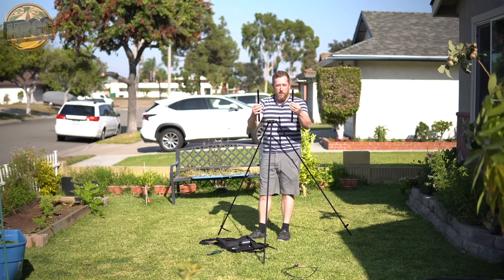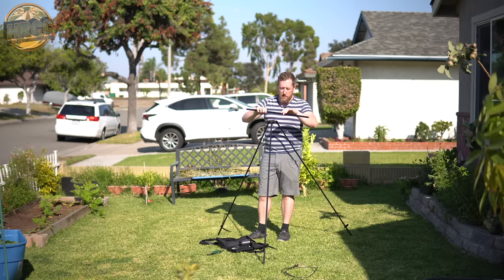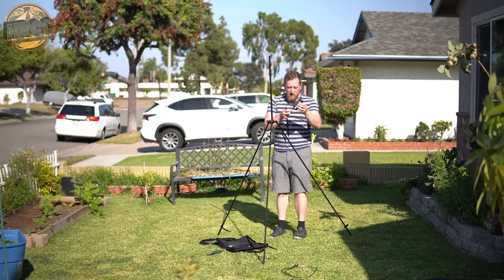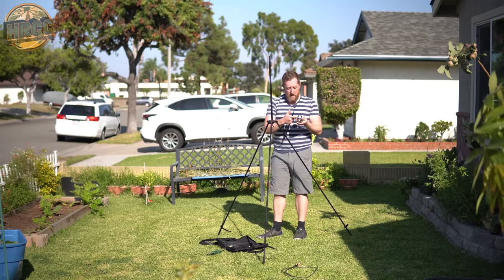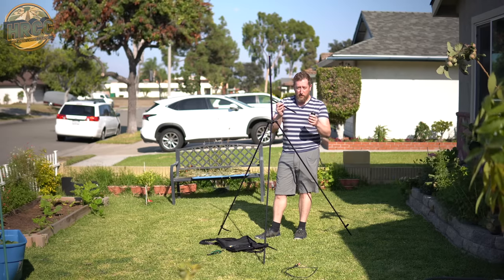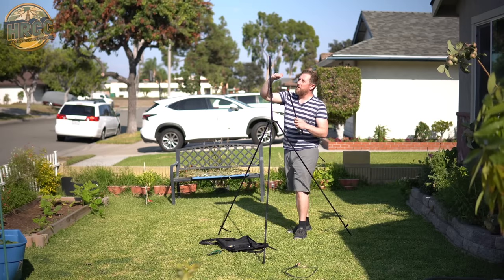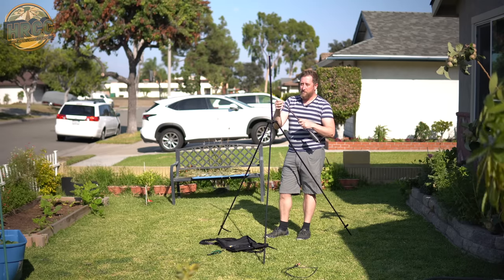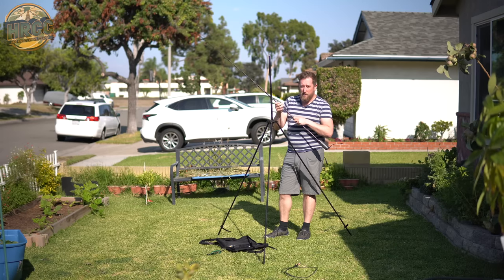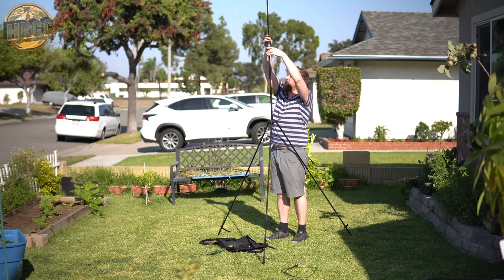Next there are two vertical rods — they both have male and female connections. Go ahead and feed them together. If you're a shorter person you may want to do this a slightly different way. Feed that on top of the tripod. The coil is where the magic happens and we're going to spend some time later in this video explaining how to use it to get the appropriate match for your radio. For setup, take your vertical, attach it to the coil. Extend the vertical all the way out to start — this will vary depending on which band you want to operate on — then feed that on top of the vertical. You will have a floating lead; just leave it floating for right now.